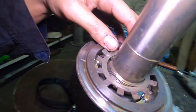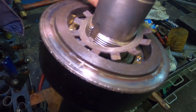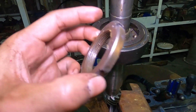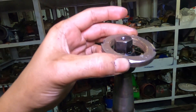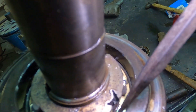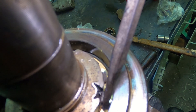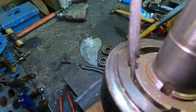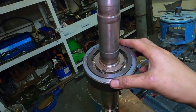In placement of the lock nut, make sure to fill it in the groove of the shaft, then install the lock nut end. Tighten accordingly. Use a screwdriver to fit the lock washer to the lock nut to hold both into place. Put the spacer — and there you have it, the complete procedure of bearing renewal.